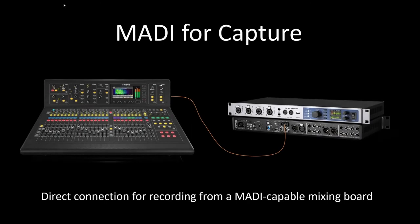The most basic use for MADI would be to connect to a digital mixer. Many digital mixers have MADI built in, and you can simply take a feed from the board, connect it to the UFX MADI input, and do a multi-track recording of up to 64 channels directly into your DAW software. One cool feature with the FireFace UFX Plus is the DURec system — a backup recorder built into the unit. You just plug in your own USB drive and can do a backup multi-track recording at the same time as you're recording in the DAW.